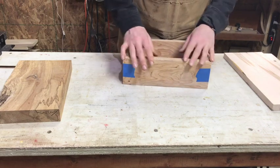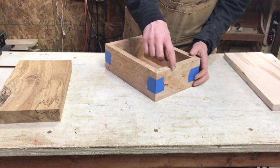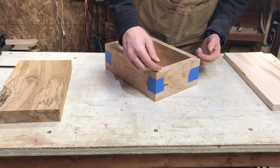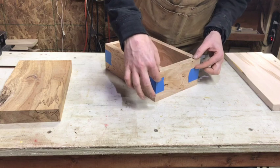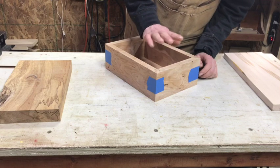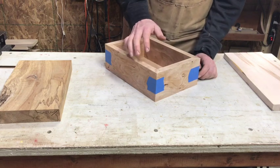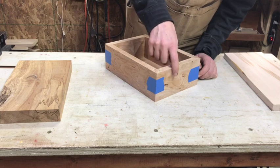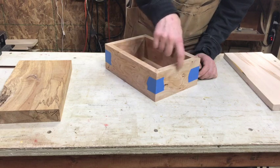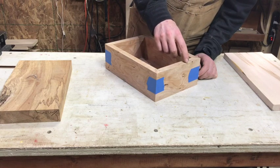The key to the sliding lid is choosing a side where we're going to cut out a section. Depending upon the box size I like to go between half an inch to seven-eighths of an inch for the cut-off. You have two options: make the front piece taller so you can use it as the top of the lid with a close match, or make sure you have another piece of wood that matches well with the grain below. If you want the best match, you have to think about this ahead of time.